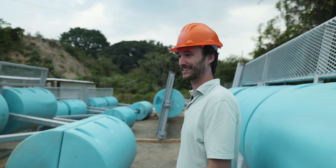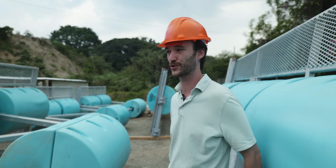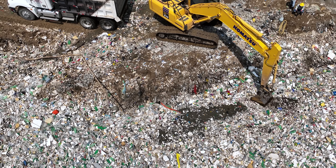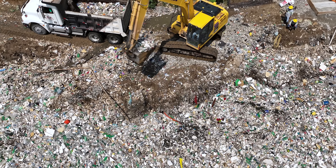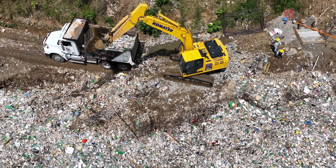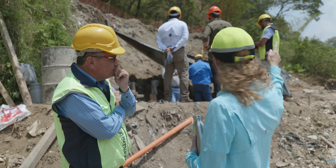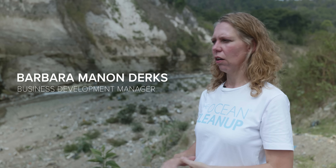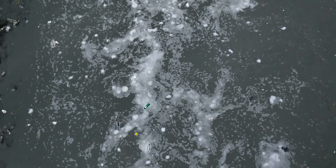Once the plastic arrives in the river and is caught by the two booms, it will be directed to the left shore due to the angle of the booms. There will be an excavator scooping it out — we have holes in the buckets to not catch the water — and the excavator will put it straight into trucks. We learned from the trash fence and all the studies we did, gathering information on the speed and height of the river and the amount of trash floating through.